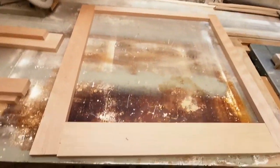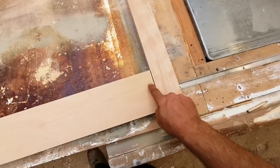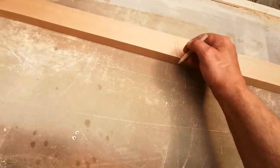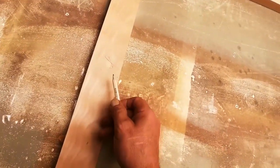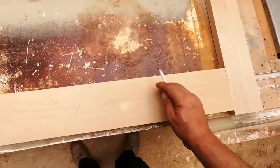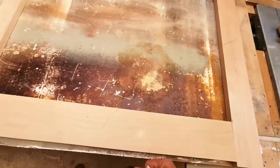So that's going to go together like that. Let's get some dominoes in here — two or three, I think it'll just end up being two. Just one in the top here. So it marks my face and into the inside edge. Like I was saying before, don't just put a pencil mark — put a little squiggle, because you can easily get pencil marks from when I'm planing the edges. Sometimes there might be a pencil mark left on somewhere.